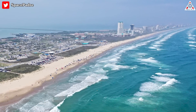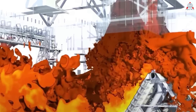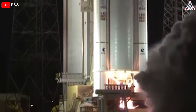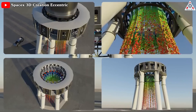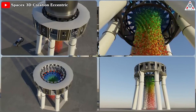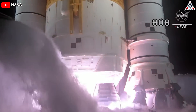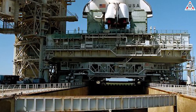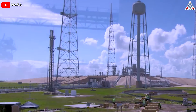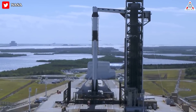There is an obvious reason why so much debris was thrown up and the launch pad was so damaged. SpaceX didn't build a flame diversion system or pump in water to absorb heat and sound energy. Typically, rocket launch sites have large concrete trenches and redirect energy away from the pad and the vehicle, while thousands of gallons of water deluge the area. Here's a picture of the space shuttle sitting above its flame trench back in 2009. It's not clear why SpaceX didn't use this kind of infrastructure, which is part of the launch setup for its Falcon rockets.